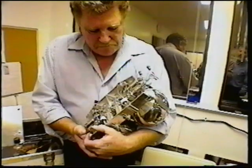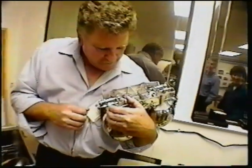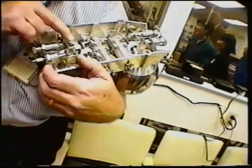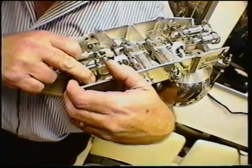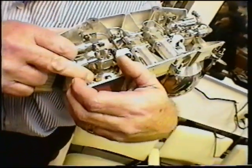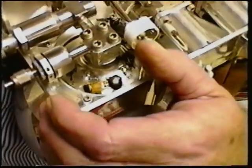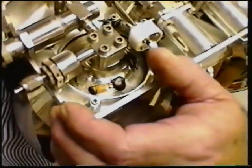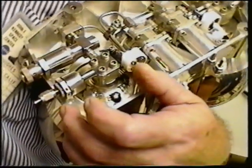And that was because — I've forgotten why that was. There are little sensors in here: one is a temperature sensor, there's a platinum wire temperature sensor over here. And this one is a strain gauge — the little guy with the brown stuff — that's fine wires looped many times in a thin film. That makes the strain gauge so it changes length and changes resistance, and that delta-R becomes the strain.